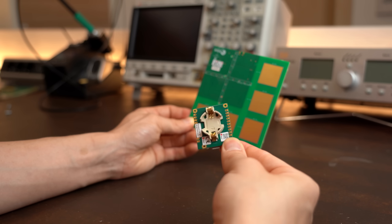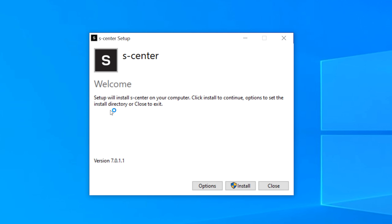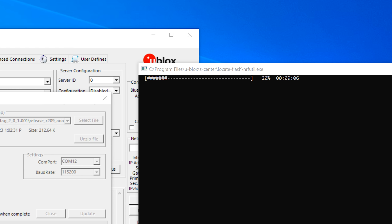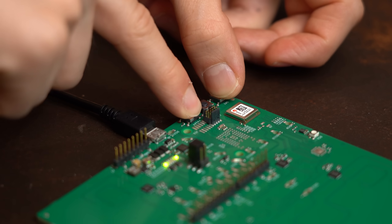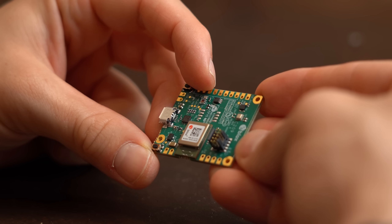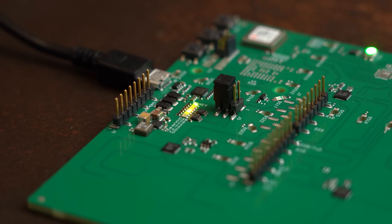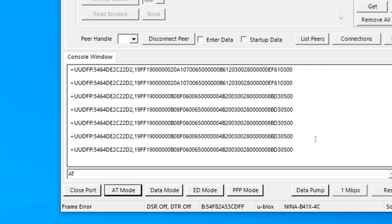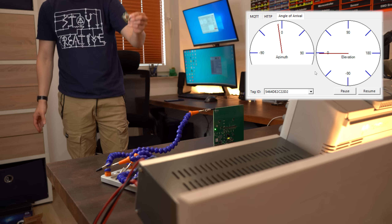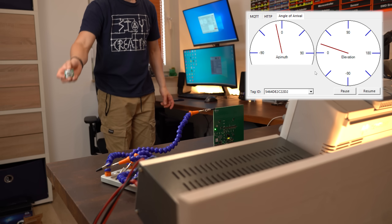To demonstrate this I had to go through quite a few steps: installing the S-Center software, uploading the correct firmware to one big board and one small board, then powering everything. Summarized it sounds quick but all in all it took me around 2 hours. The blue LED blinks meaning the tracker is sending out data, and the receiver board is outputting messages over the serial monitor — the system works. Using the graphical user interface I confirmed that the azimuth angle and elevation angle changed according to where I positioned the tracker, and this worked perfectly fine.